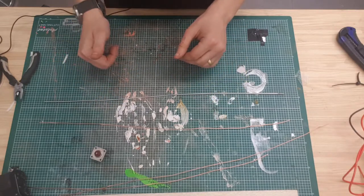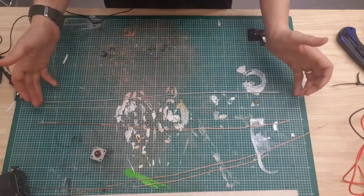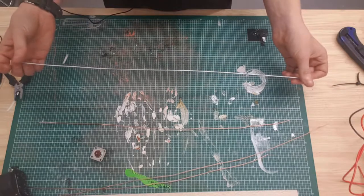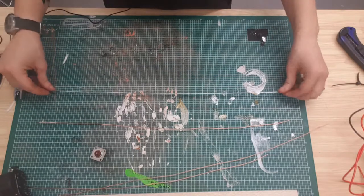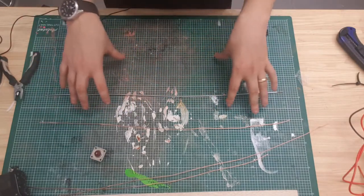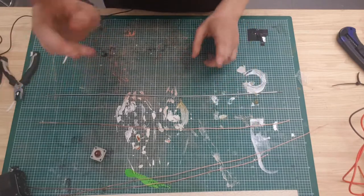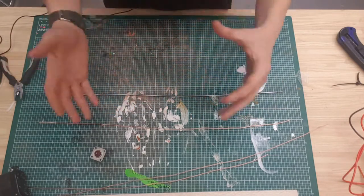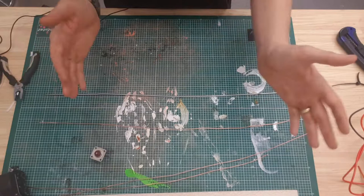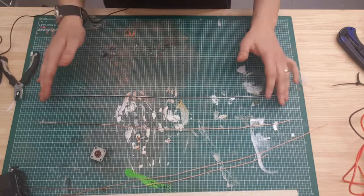So the easiest way to get it is to divide 300 by the frequency that you want to use, and that will give you the length that you need for a full wavelength. The reason that you use 300 is because 300 is the speed of light. Well, it's actually, if I remember correctly, 3 × 10⁸, I think, again, citation needed. But if you keep 300 in your head as a number, if you divide 300 by your frequency, that will give you the length that you need. And then you can divide that up for whatever wavelength you need. In this case, a quarter wavelength for the 2 meter band, it's 50 centimeters.